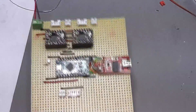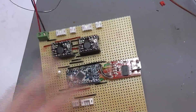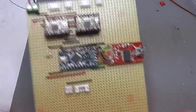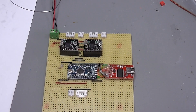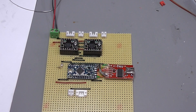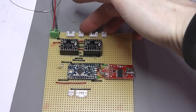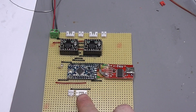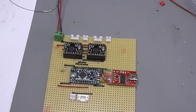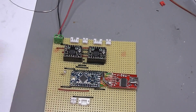This is the main electronics board, and it pretty much works as it stands - just a few more tweaks to some connectors and a couple more LEDs to put in. I've had it running with a stepper motor and I can drive it from the computer. It runs GRBL open source software, which you feed G-code commands and it translates and outputs as needed. There are two stepper motor connectors, limit switches for each, a laser output, and some switch contacts for buttons. There will be two power inputs: 12V for the steppers and 5V for the electronics.